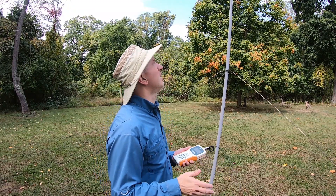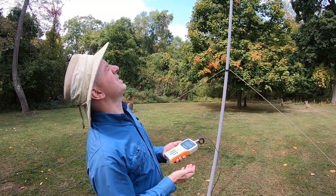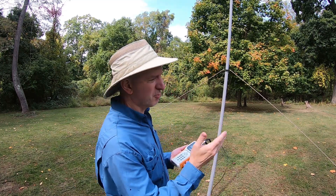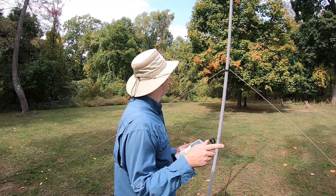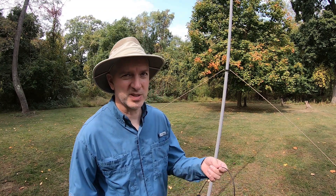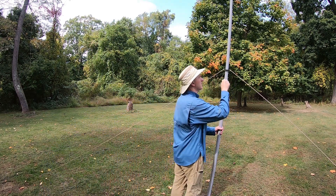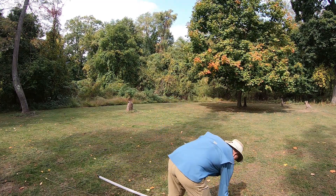So I got the antenna up, pitched pretty good. It's probably since the mast is bending over a little bit, it's probably 20 feet or so, maybe a little more. I have the antenna set — I forgot to disconnect one of the links. So right now it's set for 20 on one side and 40 on the other. So hang on while I fix that. The easiest way to fix that once you have it up on the mast is to just drop the mast. You can lower sections, but I found it just easier to do that.